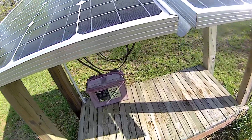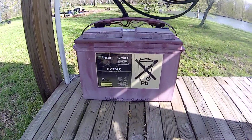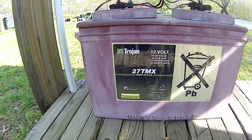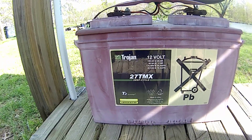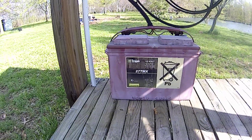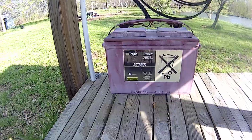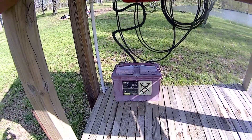I've got a 12-volt battery here — it says 175 minutes minimum at 25 amps. The pump I use draws 17 amps, so that gives me a couple hours of energy. I've never actually had it run out.